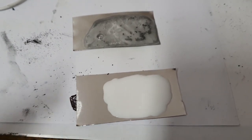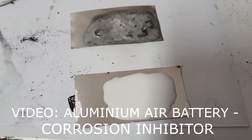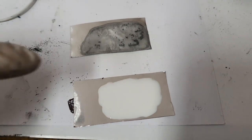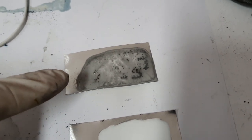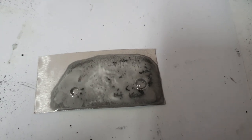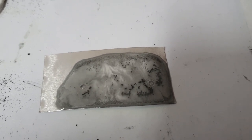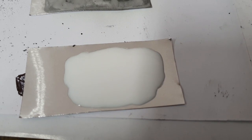This experiment is related to my previous video on aluminum-air battery corrosion inhibitors. On this aluminum foil I only put potassium hydroxide electrolyte, and on this one I put potassium hydroxide together with zinc oxide. You can see how potassium hydroxide eats the aluminum and produces a lot of hydrogen bubbles, while over here it is really quiet.